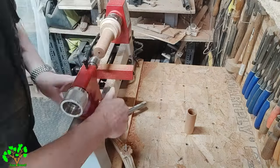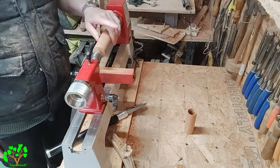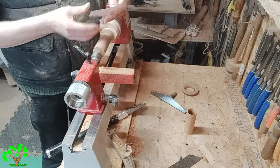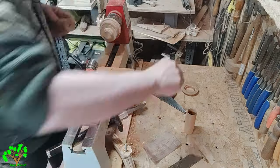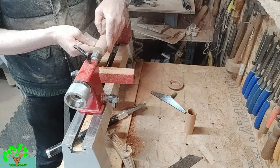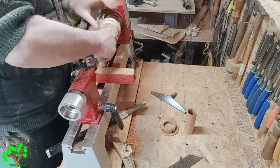I'm just finishing off the locking sleeve so that the indexing bush slides over the top quite freely. Notice I'm using my favourite jam chuck to hold the sleeve. Due to the thin wall section of the sleeve, it saves risking splitting or compressing the tube too far using the four-jaw chuck.